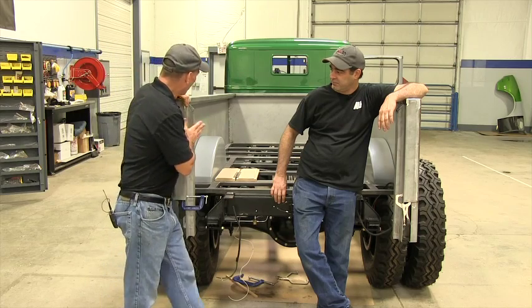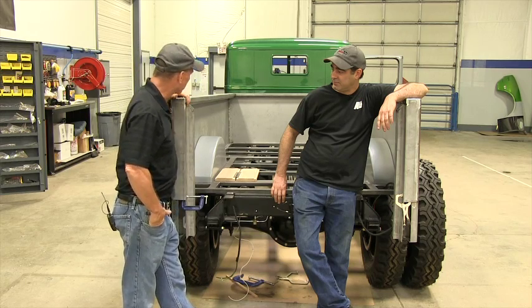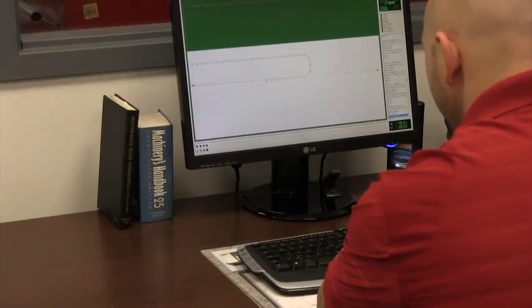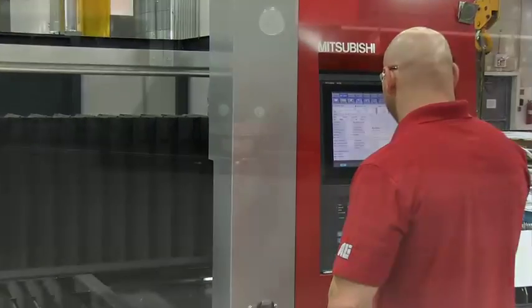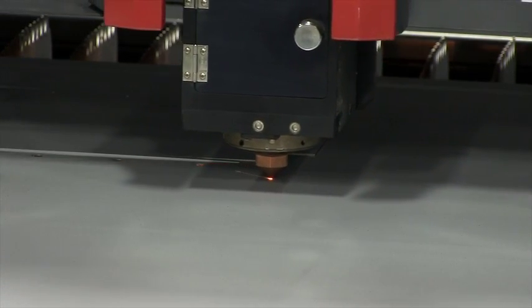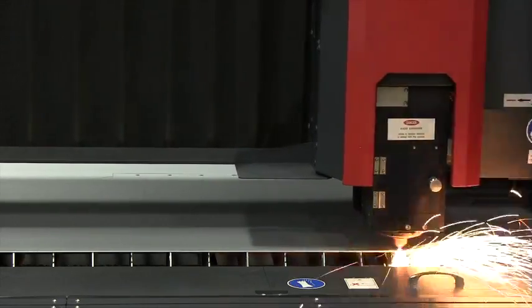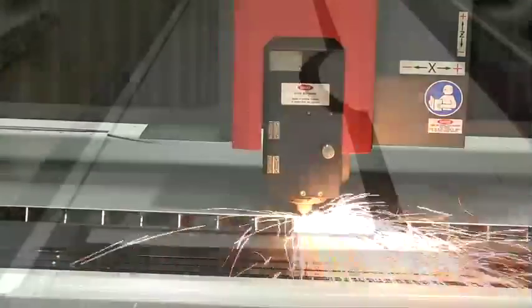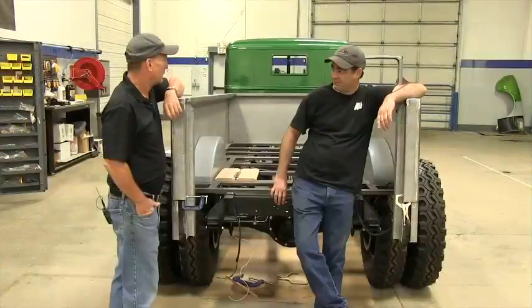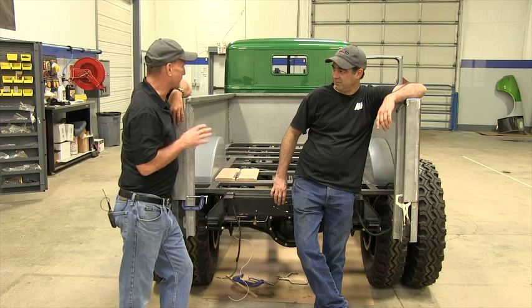Okay, now the walls of the bed — these look pretty long here. What did you have to do to make these? Well, we extracted a program out of it to load up into the laser machine, which is a pretty wicked machine. That thing is able to etch, drill, and basically cut all the holes that we need for the plug welding. It's able to account for all the bends and anything you need it to do — it can even cut wood without burning it.